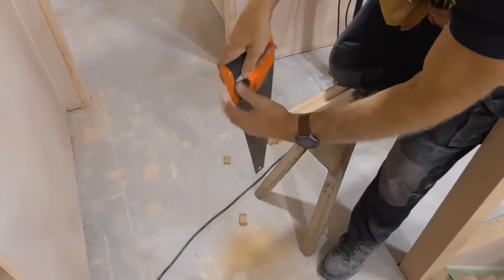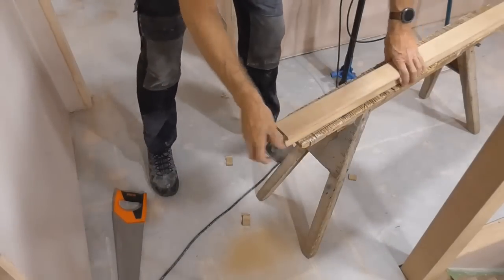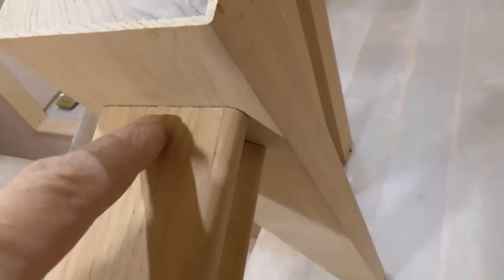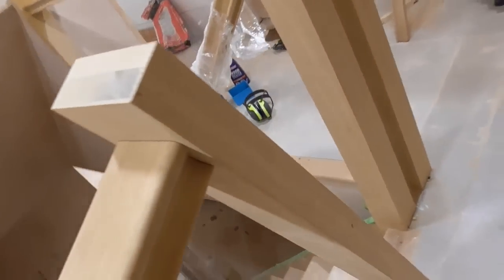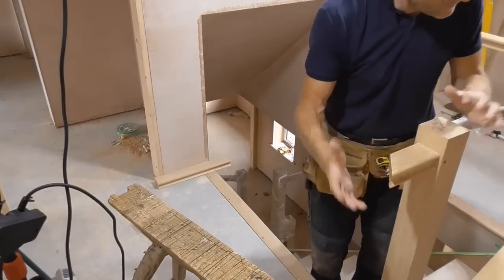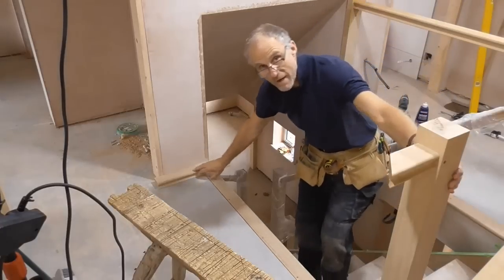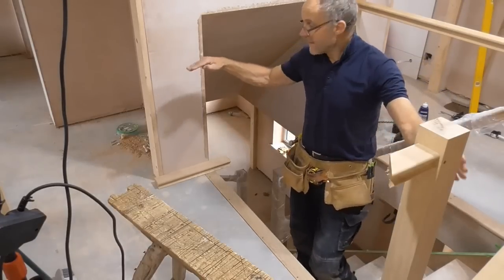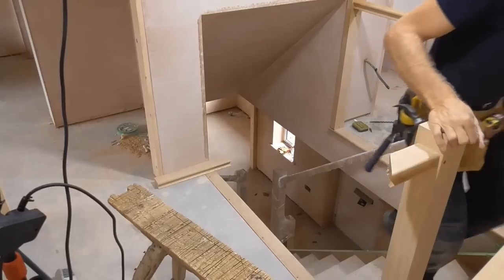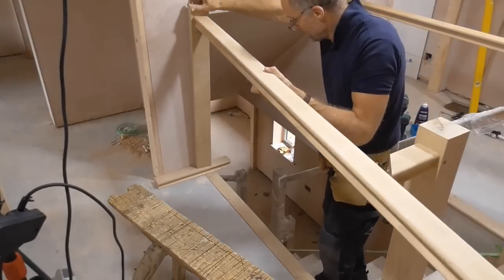Going into that last little bit - I want to go right up to the shoulder and just break that out and clean that tiny butt with the chisel. That's got the shoulder from that cut, tidied up with the chisel. Hopefully that should fit straight in that mortise - pretty happy with that more or less straight off the saw, maybe just a tiny little bit to clean out. I've got the small section of handrail in and the big section in the half newel. I've put an offcut of handrail down so it holds everything up so the handrail that comes along here sits on top of the handrail from the newel - that way we can physically mark one across the other.